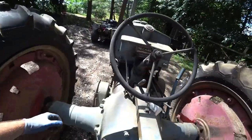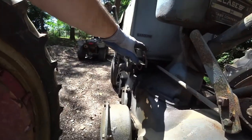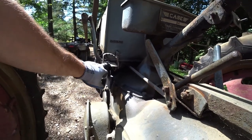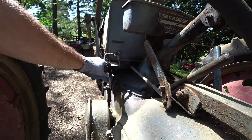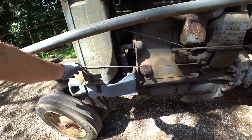Over here, I'm thinking maybe the PTO engagement. Here is your gasoline fuel petcock, and then there's a petcock up front for the kerosene. There's a piece missing here. Again, somebody put in the comments if you know what's supposed to be there. This one is missing, maybe for radiator shutters. I'm not sure. Choke for your carburetor is in front where you're going to be starting it at.